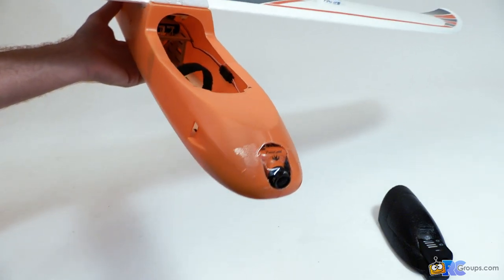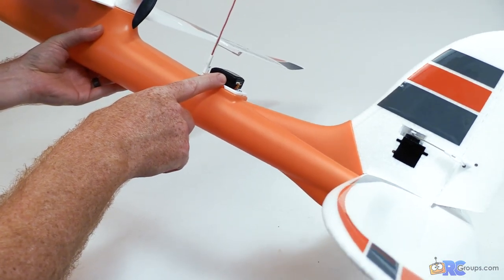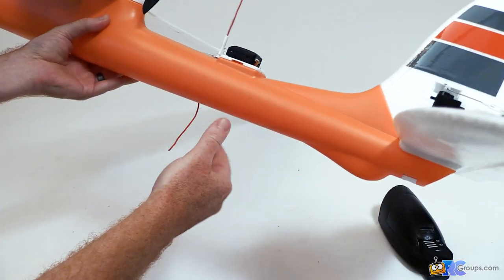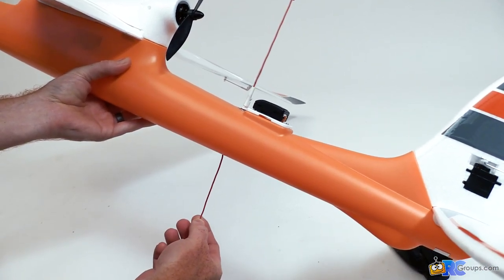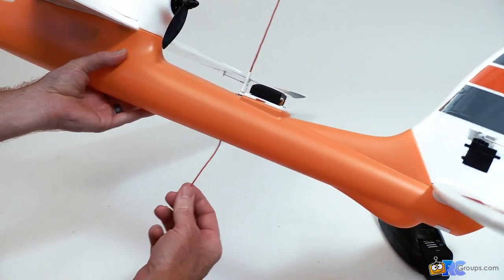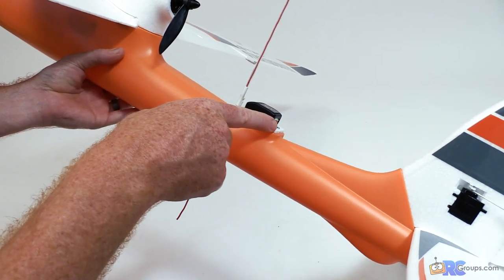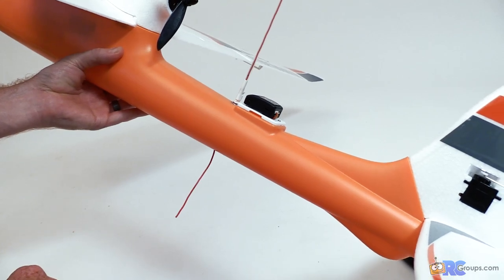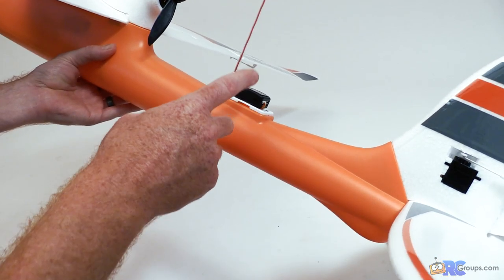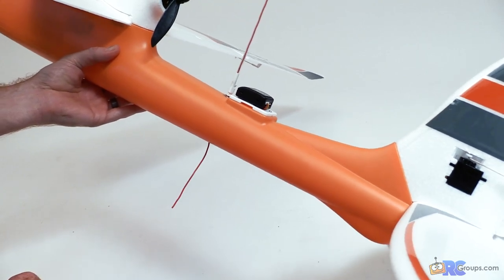If we go out back, you'll see that I have the Vector's GPS puck, and this beauty right here, antenna, is a Dragon Link 433 megahertz long range. So it fits nicely through this hole that's already there for the mounting pad that's on the back. You could put a VTX back here if you want. I chose not to. This is just a great place for the Vector, away from all of the electromagnetic interference and stuff.